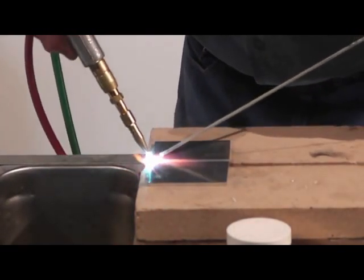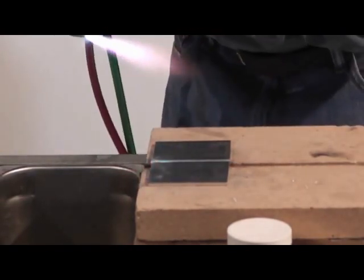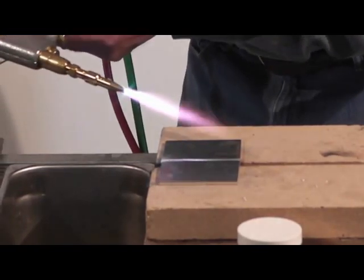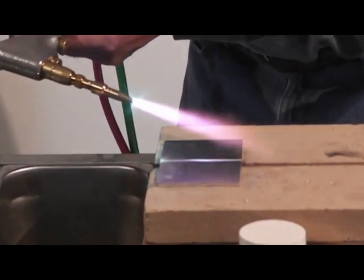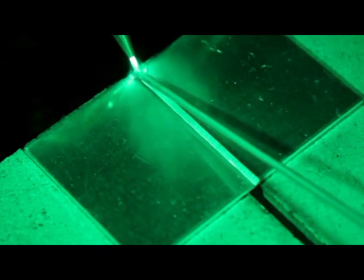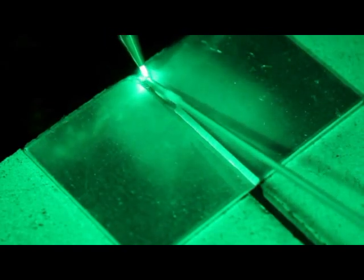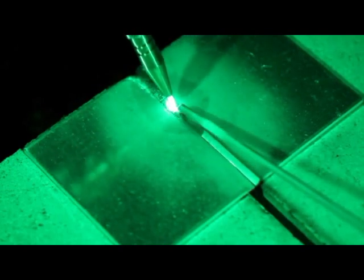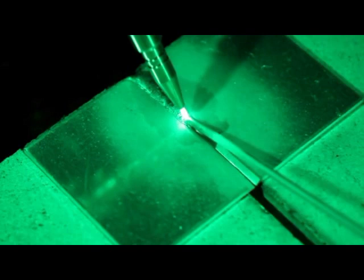Go down and wait for it to start to melt or wrinkle. Once it starts to melt and wrinkle, go back and make a smaller flame — just all feather right here. Hold that torch just like you would a TIG torch. Take that cone down closer to the metal. Get the aluminum where it's starting to wrinkle or melt, then push the rod in. Notice that we just physically melt that rod. Sometimes on real thick stuff, you can use a circular motion, but if it's flowing real nice like this, keep going.